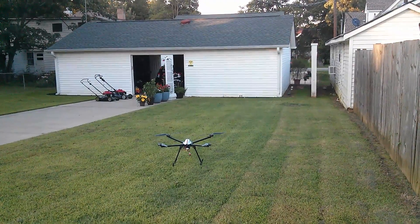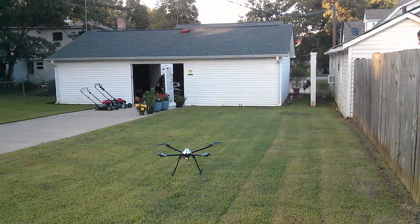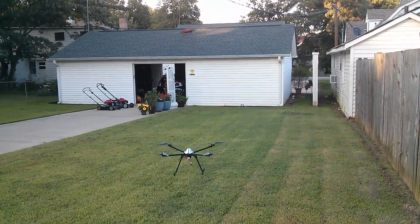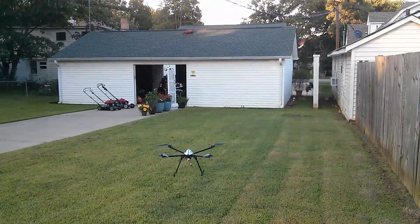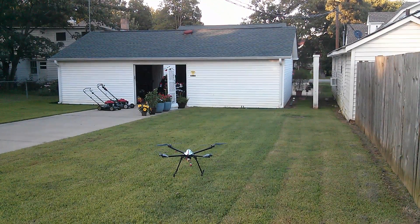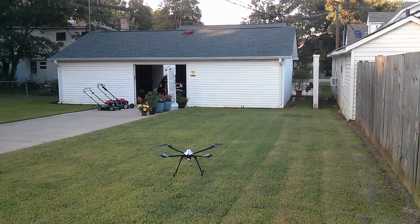This is the first flight of a large quad using 16 millimeter outrunners. We built this for Jason Desjardins. We've got some camber built into the arms — six degrees — so it'll help with descents and be a little more stable. It's a folding unit, so we'll try it out and see what it does.